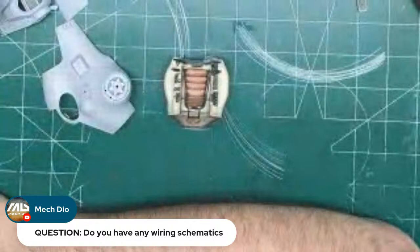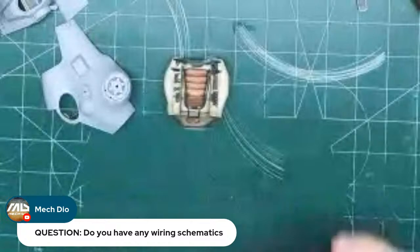What's the difference in wiring LEDs in series? I'll see if I can describe this the best I can. When you wire something in series, it's going to go from positive to negative to positive to negative to positive to negative. I'm going to use 3 LEDs in series because that's typically what I do, because I want to run off a 9-volt power source.